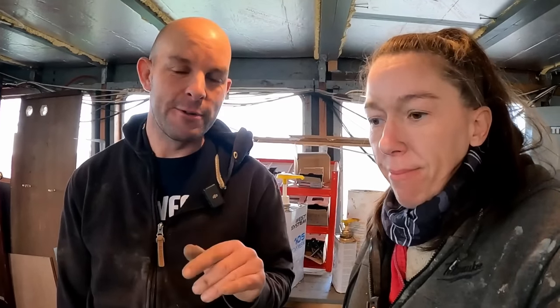So we're using a thing called power assist on the Victron, but it's a massive shock to it. And then the generator goes, I can't do that. And it goes into fault mode. Anyway, basically, we haven't got enough battery capacity. It's not the battery, it's the inverter. We need an extra... Yeah, you can actually stack these inverters up.